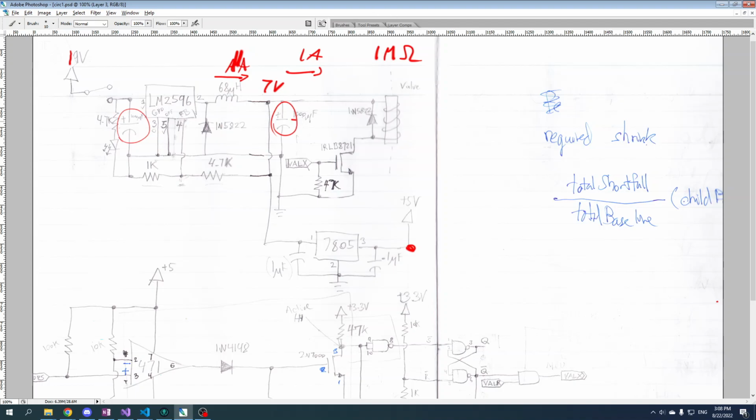But if you have, let's say, a nice big capacitor in here, when your load says, okay, I'm now a giant resistor, that current just basically gets dumped into your capacitor here. Your capacitor charges up a bit, and yeah, you're going to get a little bit of overvoltage, but you're not going to go to 1,000,000 volts, right? You're going to go to a number significantly lower than 1,000,000, but somewhat more than 7. So that's one of the reasons why you would have this capacitor here. It's a little place for the current to go when it doesn't need to go into the load.